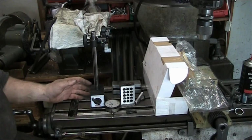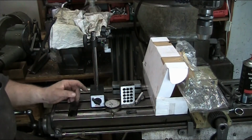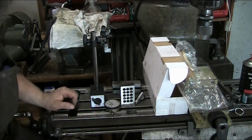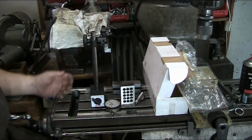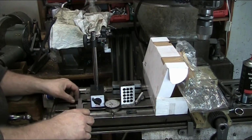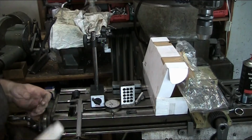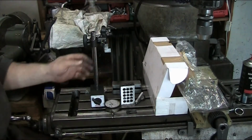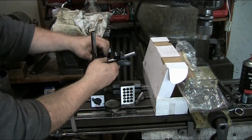Okay, so here's the Noga under license to Holex, or I don't know how you'd put it, the Holex under license from Noga, privately labeled for Hoffmann. Just a simple dial indicator base. Excuse me. Right in my throat there. The pillar here is 22 centimeters, so 220 millimeters by 16 millimeters diameter. Again, just basic mag-base stuff here. There's nothing really to write home about.